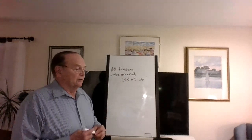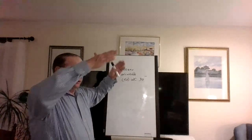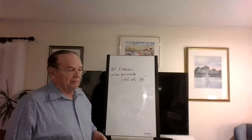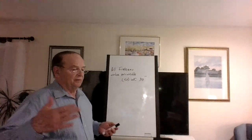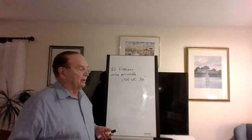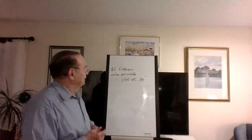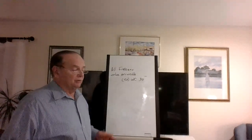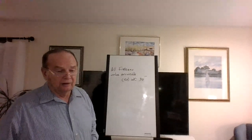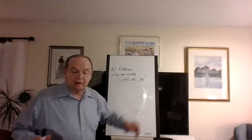Now, the other ones, let's say they're putting a bathtub in the eaves, with the ceiling that comes up. Kind of common sense. You don't want it where if you're standing in the tub, and you're taller than 5 feet, you're going to be hitting the ceiling. I've seen a few that were borderline. Again, if you got a situation like that, take some exact measurements, run it by the inspector first. Okay, if he's okay, and the owner's all right with it, that's fine.